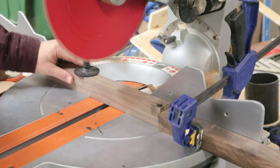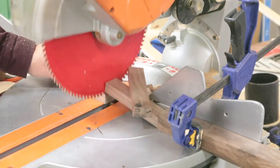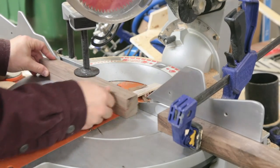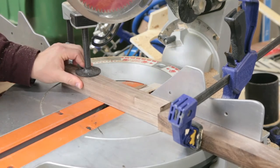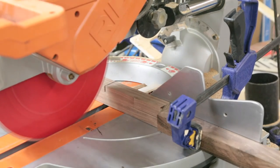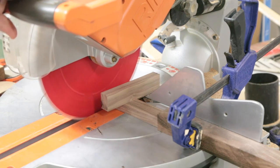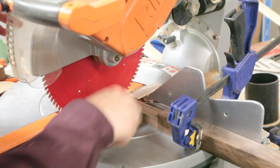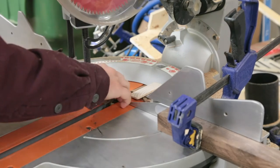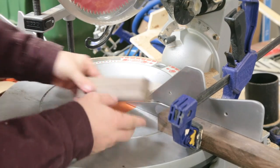Here's my PSA for the day: this is called a captured cut because it has a stop block on the right that prevents the piece from moving to the right once it's cut. Once the blade cuts through, the teeth can pick up that top piece and move it. If you make your cut and then lift the blade up while it's still spinning, the blade can actually grab that piece and the bottom piece, wedge them in, and send it flying — causing you to have to check your tool to make sure it's not broken and your pants to make sure they don't need to be changed. If I had turned these pieces a quarter turn, they would have been better supported and the top one wouldn't have kept turning on me. Either way, you do not want to lift the blade while it's still spinning.